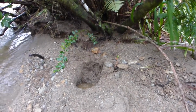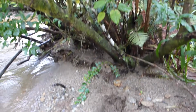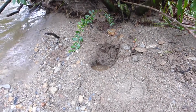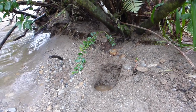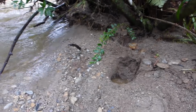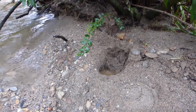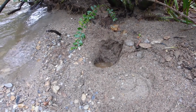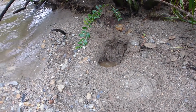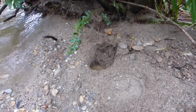a slight clay layer. It's a dark brown clay amongst the roots of this rainforest trees, and we're getting a lot of colour out of that. So it's like a false bottom. It's the fine gold sticking in the side on this inside bend up in that high layer, because really the wash in this creek would be quite deep. It could be several metres. I don't see any bedrock, and the bottom could be anywhere. So this tiny hole I've dug has been very productive. I'm going to keep working this, and we'll put another dozen through and keep cleaning that little sluice up, and we're getting a nice run of colour here. It's really good.